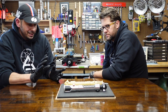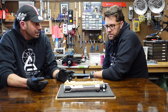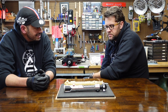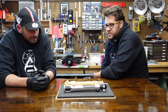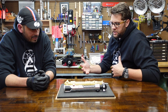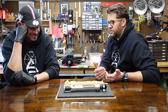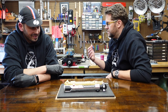You know, I've seen the pictures online and everything, but once you actually get to see it in the real world, you can see all the manmade imperfections. And this is made on a CNC — I wonder how hard it is for the CNC to do the inaccuracies. As long as you program it correctly, it can do a lot of what you need it to do. The problem is there's a lot of counterintuitive programming that has to happen. When you design something in CAD, you make a couple of choices and then the computer makes other choices for you. You have to then tell the computer to undo those choices to get it to machine it the way you want, not the way it would intuitively guess.